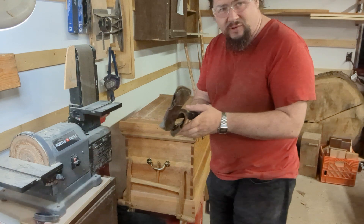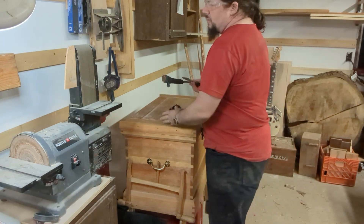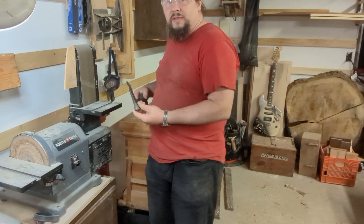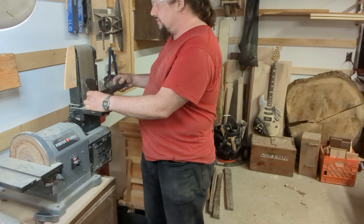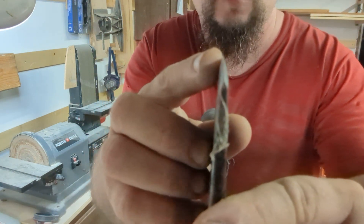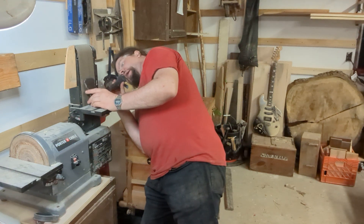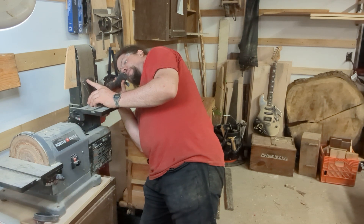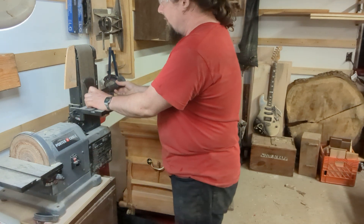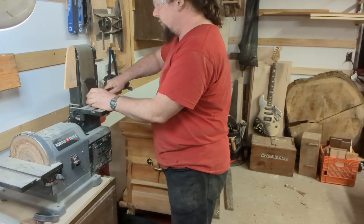The second thing to do is grab your axe and make a few observations. This is an axe I've had for quite a while. You want to pick a fixed distance from the edge of the table in this dimension and try to match the bevel angle right here. You might add a micro bevel closer to the edge with the stone, but for now you just want to match this angle. Simply look from the side and adjust the distance until that angle matches. Then you route the base of the axe head to that spot. We just pivot it on that spot, turn the grinder on, and sweep through the arc of this shape while holding it on that spot.